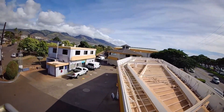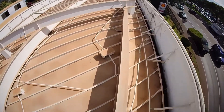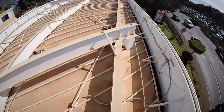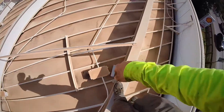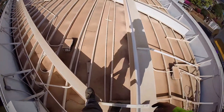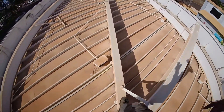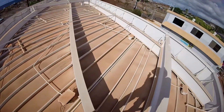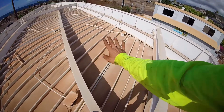This is the top of a canopy if you've ever wondered what a gas station canopy looks like. This one's actually quite clean. There are these junction boxes on top, and because these are metal halide bulbs which require a high voltage output, you have these special boxes — they have a mini transformer inside each one.